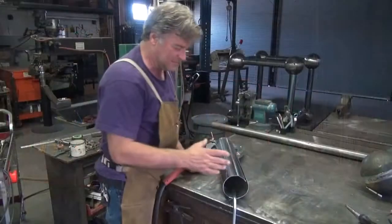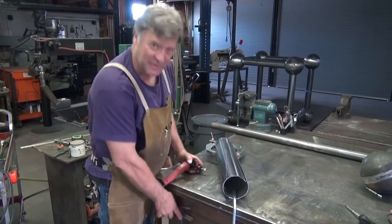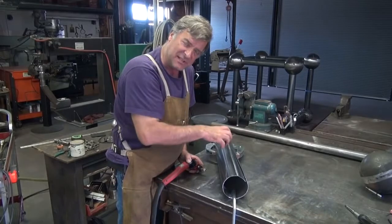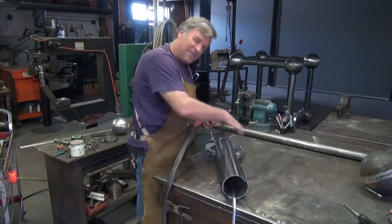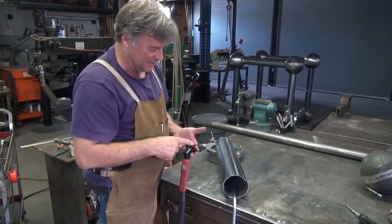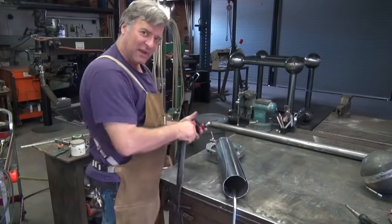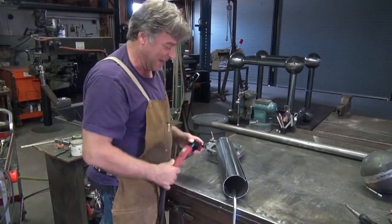It's really pretty slick. I got my piece of pipe clamped down on the bench. Got my ground out of the way. I added this other clamp to the end because I've already made one cut, and I just want to help stabilize things a little bit so as I'm working across this way, I'm not having to fight things moving around. The cool thing is what happens to the wheels as I'm following my line going across the edge of the pipe — the wheels want to go straight. So you've got to kind of work it two ways at once. It's really kind of fun to watch.